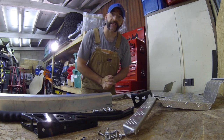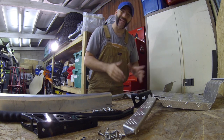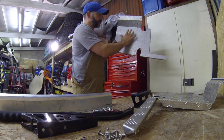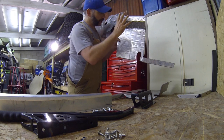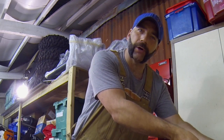The next job is to fit the new footwell. I have two footwells — the old one and the new one — and there are some subtle differences. On the old footwell, the foot rest area is quite big and the hole for the pedals is quite small. On the new one, the foot rest is quite small and the hole for pedals is quite big. That's because the vehicle has gone from automatic to a gear shift, meaning it needs a clutch pedal — an extra big space for three pedals instead of two. So it's out with the old and in with the new.